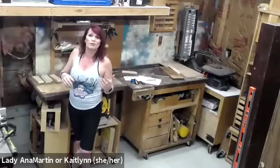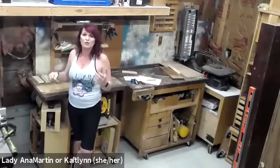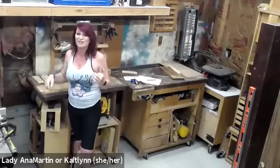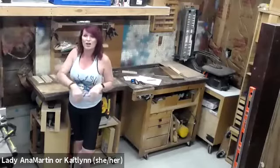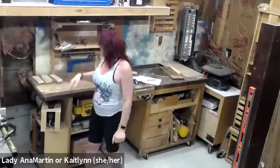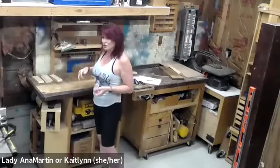By the way, if you've got a door like that that's got a big hole punched into it, you can buy door skins. It's just 1/8-inch lumber already cut to almost the right size, and you just glue it on and that hole is gone. Make sure that your door will still shut though, because that's important.